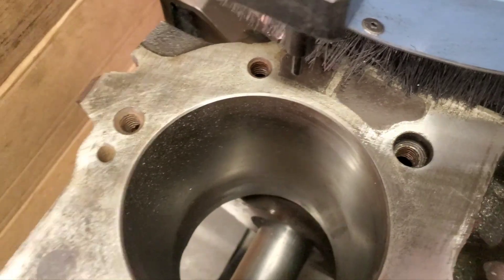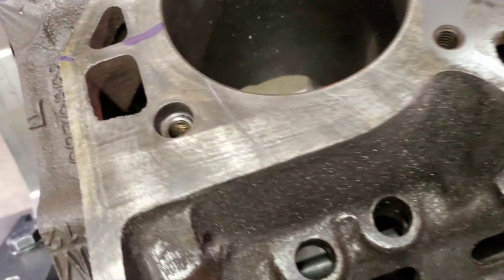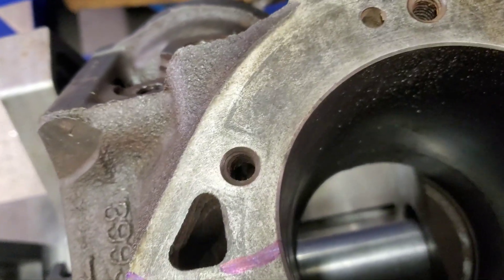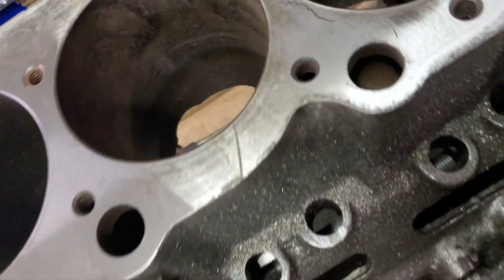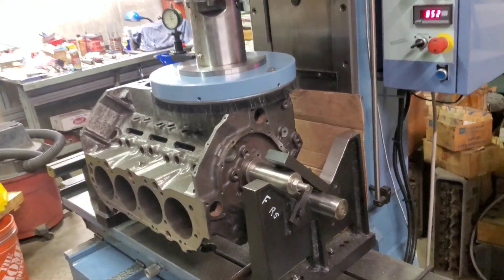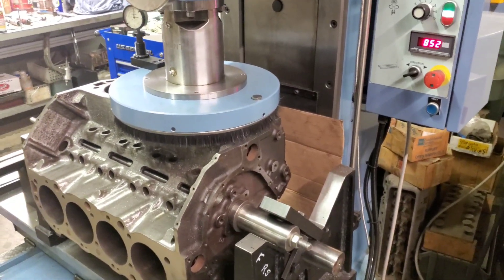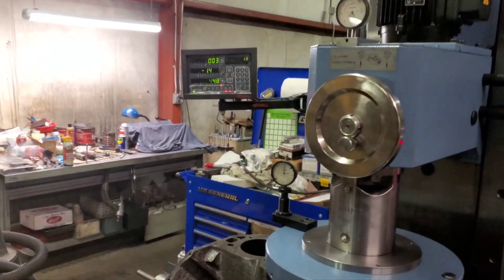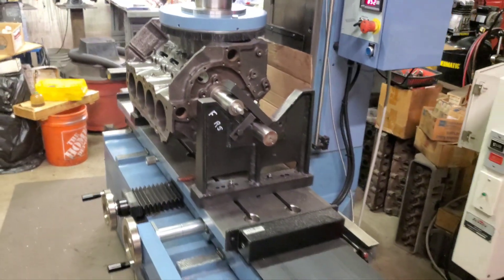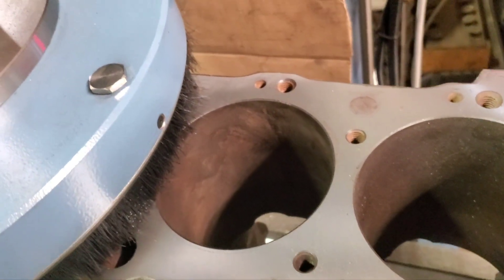You can see we're touching here, over there, here, over there, here — nothing here, touching right through here. That's side two of the big block, driver's side — we did the passenger side first. First pass, three thousandths — cleaned the front part nicely all the way across.